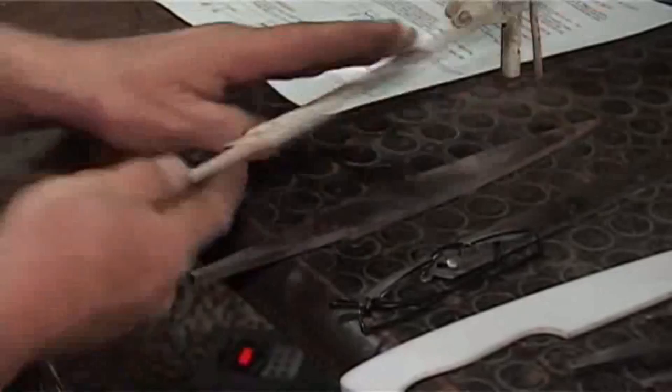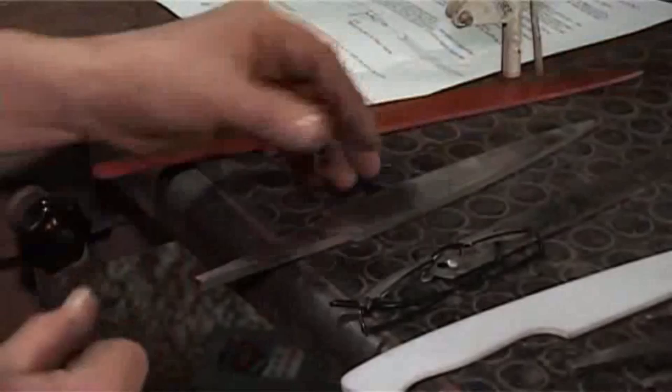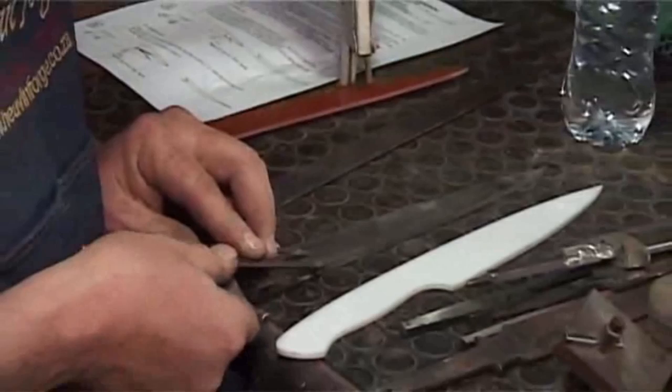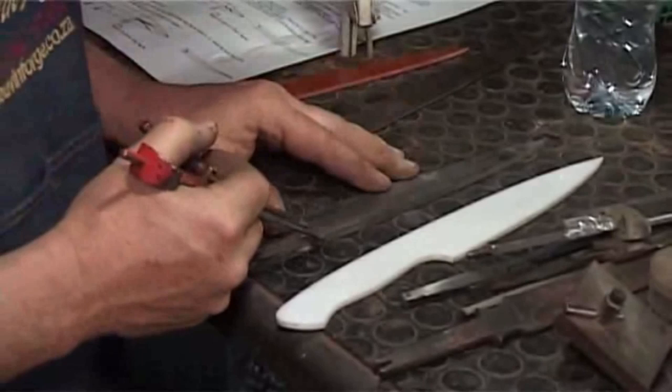Right, so once you have your two outlines laid out, now you need to get the center line perfect. The way I do that, first specs. I haven't been wearing specs for all that long, and sometimes I quite haven't decided whether I want them or not. All right, so I would take my dividers and set them at a size that looks approximately like the center, like that. Make a slight adjustment. If you're not quite right, you adjust by half the error.